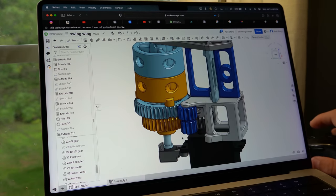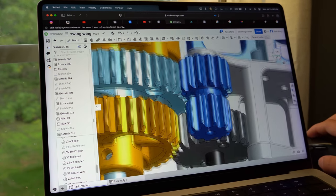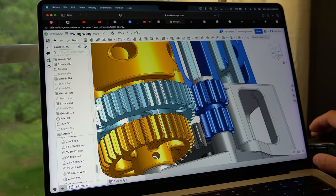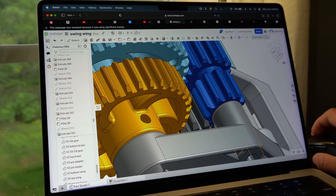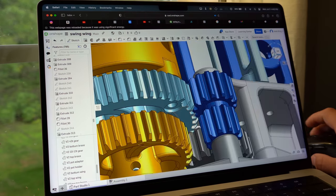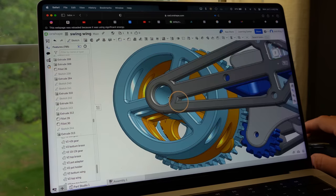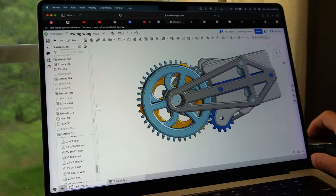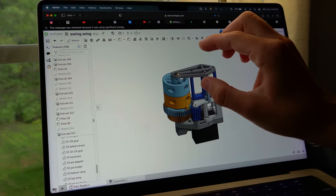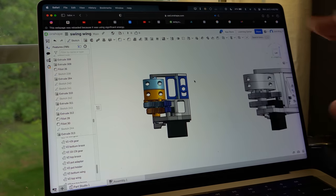And then to swing this wing, the servo rotates this pinion gear that has 10 teeth on the bottom, 13 on the top, and then that ends up rotating this 43 tooth gear, which is just absolutely beautiful. This is my favorite part of the design. It just looks so good. You know, whenever you finish a CAD model, you gotta look at this thing for hours, you know what I mean? The other thing, if you look at it, you can tell there's no room for bearings, and also, this hole is big enough for a carbon fiber arrow shaft instead of a brass rod, which all make this part just so much lighter, smaller, simpler, and absolutely beautiful. Okay, let's go build this thing.